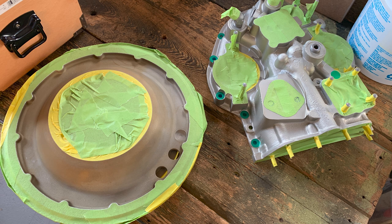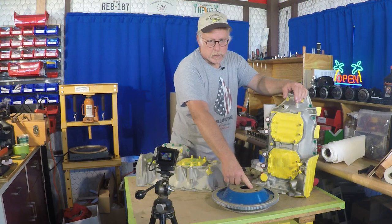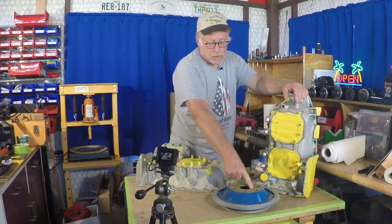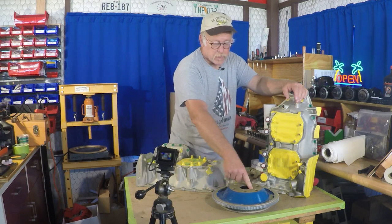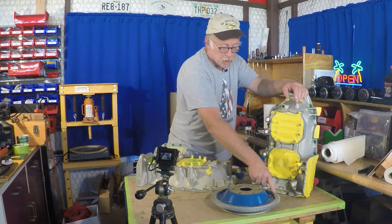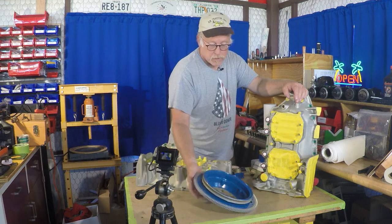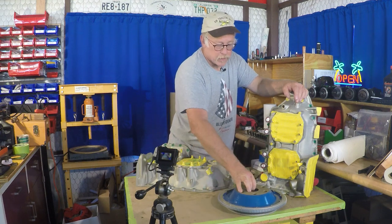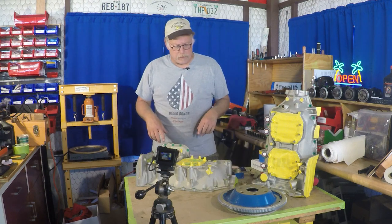It's a little bit tedious but very important to do. The other important thing is when we are cleaning it up, we identify where the zero mark is for the large bore bushing. So that's all cleaned up, we can identify that. We've got our markings for our timing both on the front and the back, all cleaned up. We'll actually infill those with some different color paint so it's a little easier when we're doing our annuals and installation.